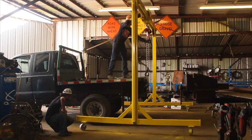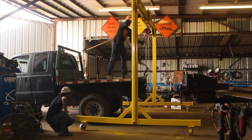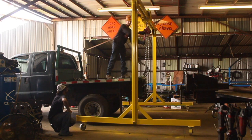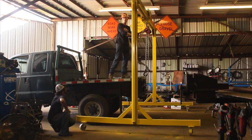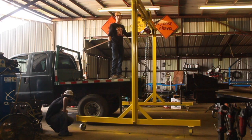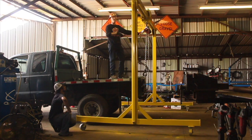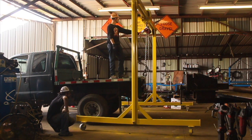Other than that one little initial bit of deflection at the beginning, I never had any problems with this gantry. I've picked up so much stuff with this and used it on all kinds of projects. When I originally made this video, I designed it in my mind — obviously I'm not an engineer — to be able to pick up two tons. A lot of people in the comments said I'd never pick up that much, but then an actual mechanical engineer got on there and was very generous. He took the dimensions and the sidewall thickness of that tube and figured out that in most applications this would be rated for at least three or three and a half tons if it were commercially built. So that was really cool, and I'm very grateful to him for that.